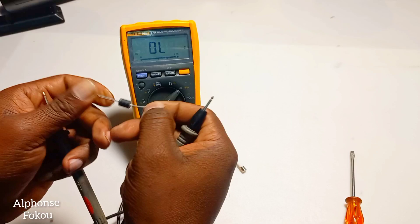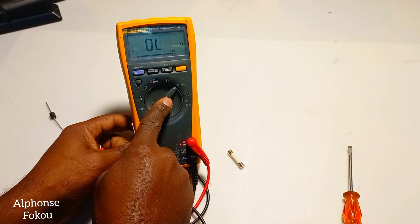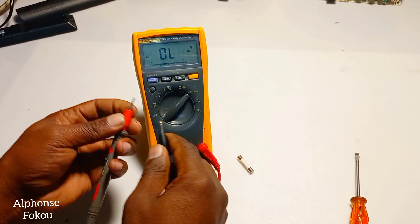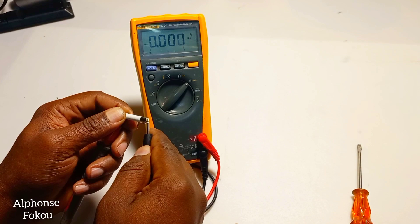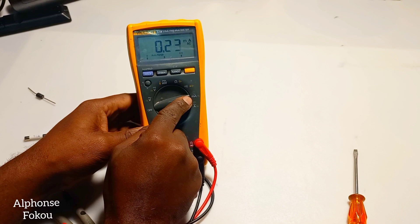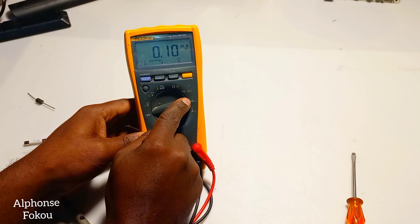There's another option — scale it to just continuity. When you do that, it makes a beep sound. If you take a fuse and test continuity: when it's good it makes noise; if it's not good it makes no noise. Very simple. If you go to the mA position, you'll be testing your milliamps — the current flow in your circuit. I hope this video was very useful. Don't forget to subscribe to this channel — it's a channel of entrepreneurs, technicians, and business people. Subscribe and share.